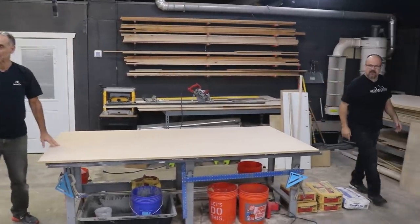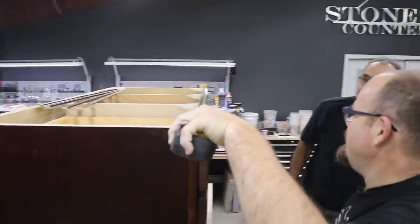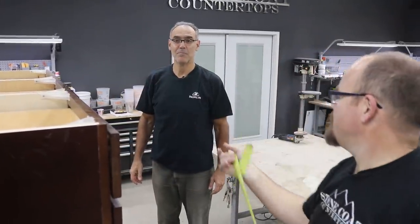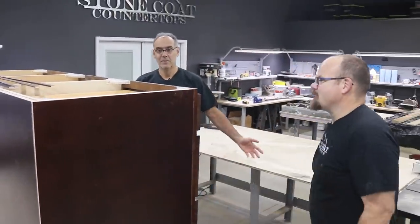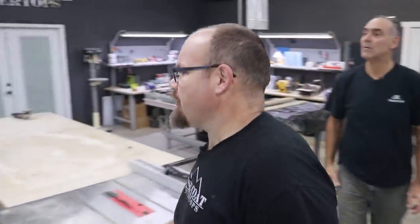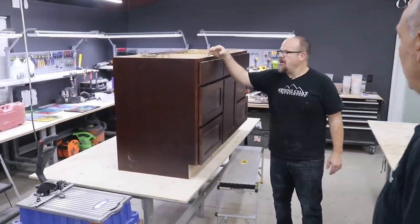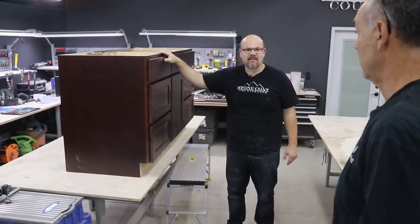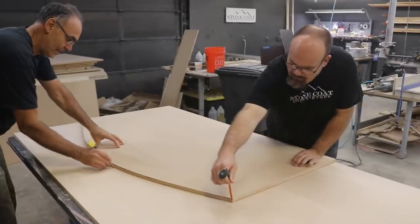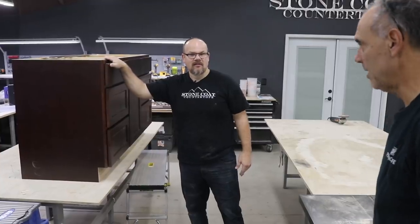Let's go to our dimensions of your island and then we'll figure out what kind of overhang. This should be 60 inches — five foot by two foot deep. 24 and three-quarters because it's a 24-inch box with a three-quarter inch face frame. The reason you want inch and a half is because you got a three-quarter inch drawer, plus a little button that protrudes another quarter inch — so you're at an inch. And you want your countertop to overhang those drawers at least a half inch, just for the aesthetics and the drip edge. We'll account for 12 back there and inch and a half around the box.